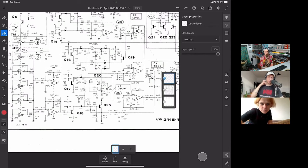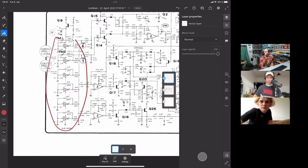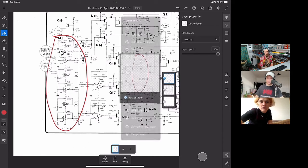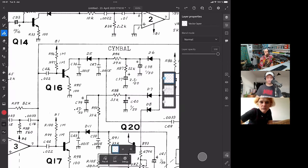And so I was wondering, if you just take these square wave oscillators straight up and mix them, it's not going to sound metallic. So I was thinking, okay, how do they do that? And in a different section of the service manual, they explain that they use these VCAs for it because these VCAs are really bad, if you will. They're really bad at doing their job, basically. It's kind of like a crude approximation of a real VCA. And so that's something that I actually want to try now,